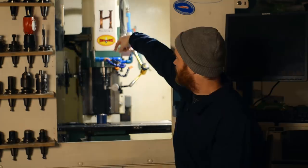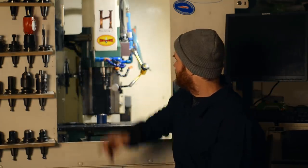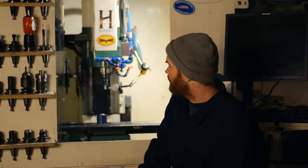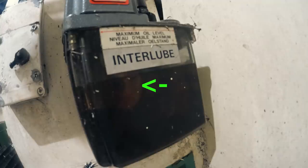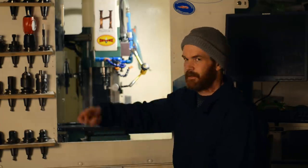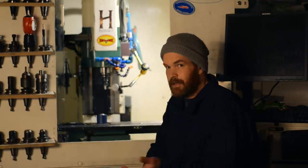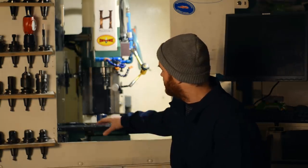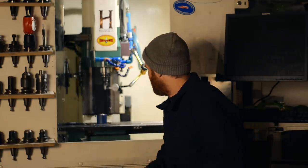Tear this off and see how much we have to tear down before we can get to that adjustable nut thing I'm hoping is there and tighten it up. Got the automatic oiler working and it's set to give much more oil than I've been giving the machine, with the occasional pulls on that plunger there. So that might be one of my problems, might be that it's been starving for oil and stalling because of that.